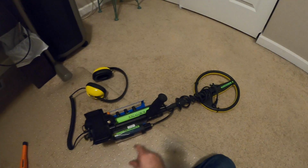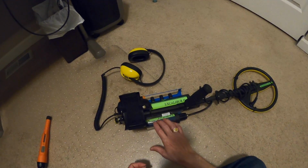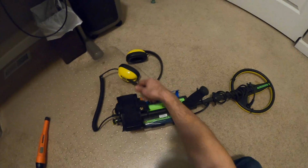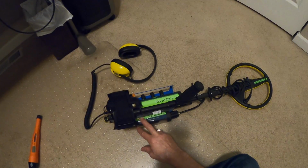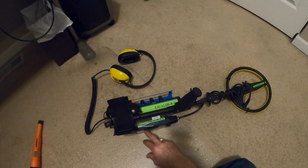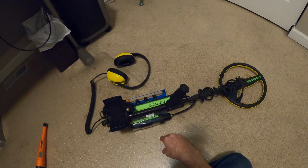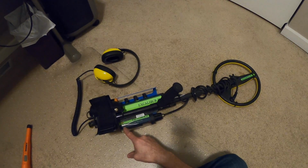to do the testing. Metal detector's got your EMI coming out of it, it's sending out a signal. So what happened was really crazy. I actually had it in the open position, all like this, turned on the power. The detector didn't come on because this was a normally open switch until the magnet came. It closed the contact and it was running. I took the magnet away and it stayed on, and I was like, oh my goodness, I've just welded the contacts to this switch again.